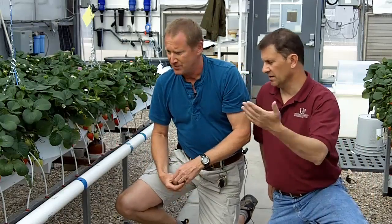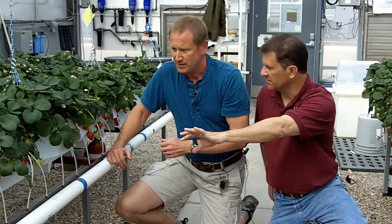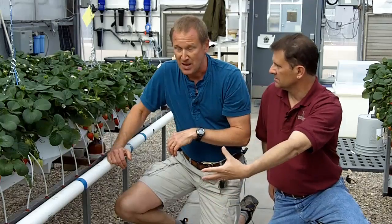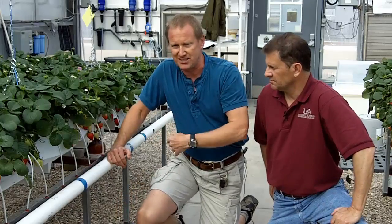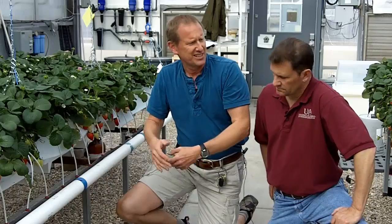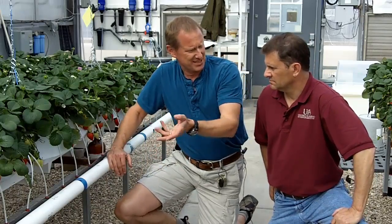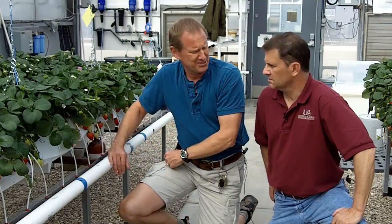Thinking about sustainability and being environmentally friendly, it's much better to capture drainage from the bottom than to simply let it go to the ground. If it's non-recirculating, you can take it to sewer, or some people collect it, blend it, and put it on their fields as a fertilizer. If you're recirculating, you need to recapture that drainage and deliver it to your sterilization or recirculation system.